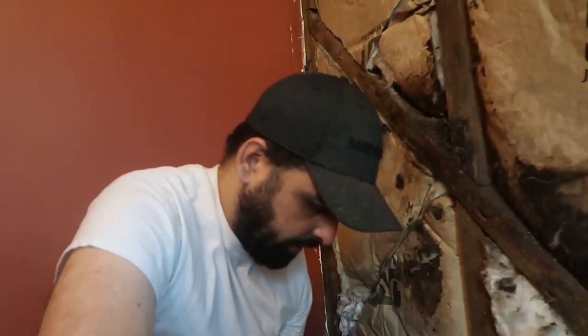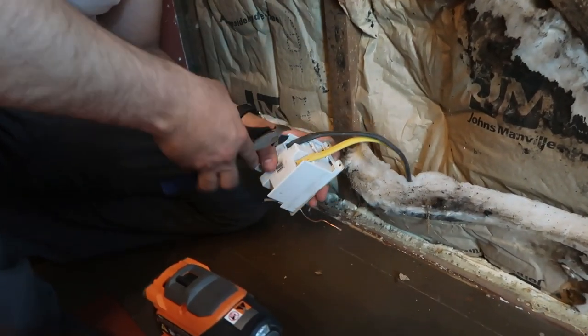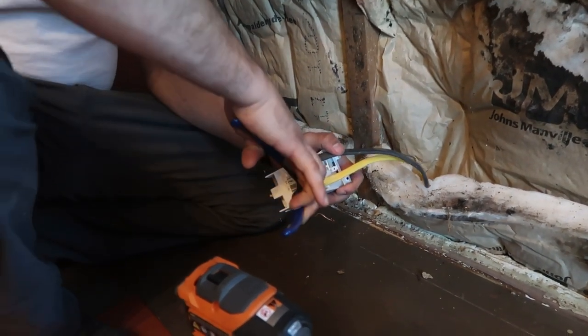Because if you did the brand new wires, you would have to hire an electrician. Well, no, I wouldn't, but my ground wire would be too short, and then I would have to either lower the box to give me more wire or run a new wire. Or risk having a connection that's not so good in here, which we don't want, loose grounds. So I think this is the lesser of two evils, is to just simply run them. So I will destroy this box in the process.